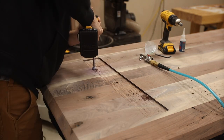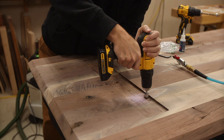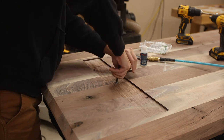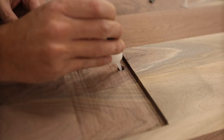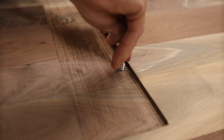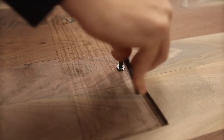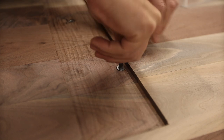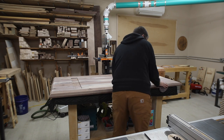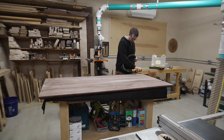I put a stop collar on a drill bit and drilled out for the threaded inserts, then used a countersink bit to round off the top of each hole before securing the threaded inserts inside. I used a little CA glue to put those in — I'm using Starbond, and I'm an affiliate, so if you want to pick up some great CA glue click the link in the description for a discount. I finished off the bottom with hand sanding, then applied finish to the whole bottom and let it cure.